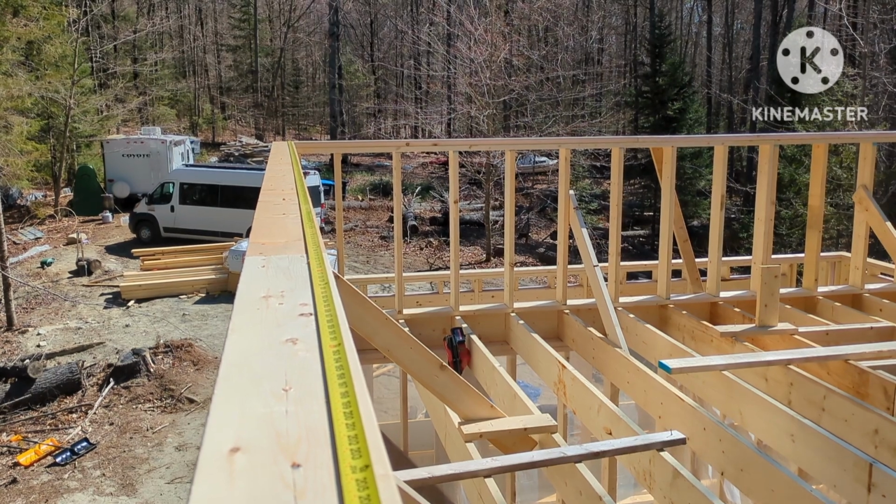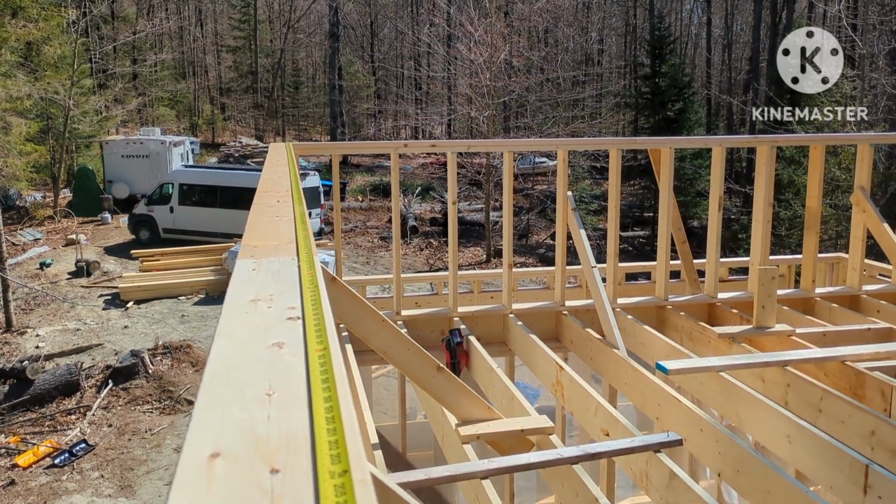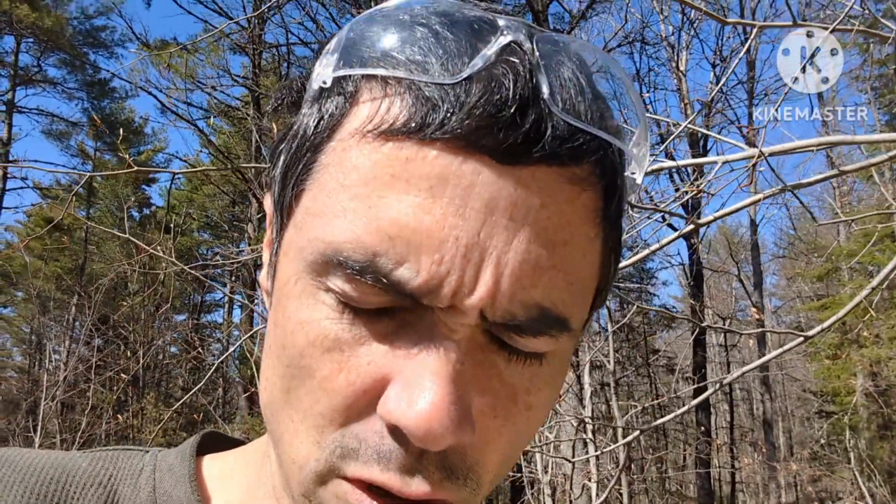I'm going to measure the width of the house. I know that I have a planned 12-inch overhang on the eaves. So basically the roof will extend 12 inches past the roughed-in side of the house, excluding the sheathing and all that, basically the framing. So it'll extend 12 inches past on the sides, 18 inches along the plane of the house. And let me see. So I know that, so I can build the ridge beam. I can get it up here.